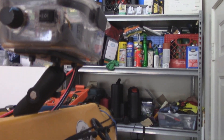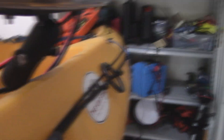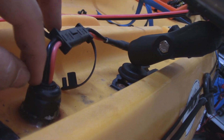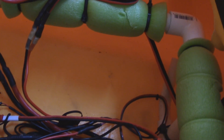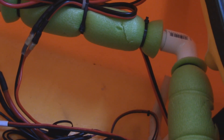Back to the power box — I have it mounted on my yak using a RAM ball mount. I like to run the wire through the yak, so this is the power wire connected right here. You can see it's got one of those waterproof nipple things that you can tighten down and make a waterproof seal. I run that wire through the kayak to the main hatch. I've got a little battery holder and one of those yak power packs that I use for lights and fish finder. Everything connects up front, and the battery is 25 pounds so it doesn't weigh the front of the yak down that much. I just like the batteries and electronics inside the yak — less clutter, less things for fish to pull around.